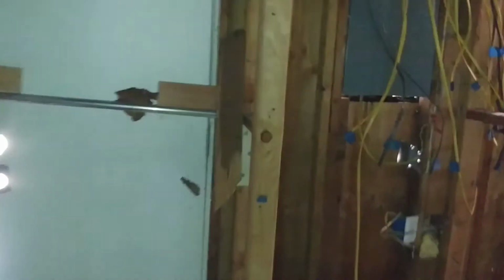Now this is something that's important. If you're going to wire a house, you want to make sure you do something like this. See, that says FAU, that's for the forced air unit, number 17. I happen to have numbered on my plans all these different ways that I'm wiring stuff. Let me show it to you. This is unfiltered, people.